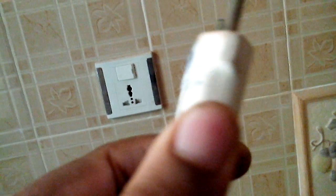You have to check which wire from this socket is the neutral. After checking, I found that the green wire is the common wire, which is coming from the WAPDA and also from this socket. So the green wire must be neutral.